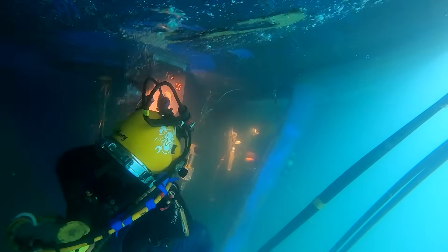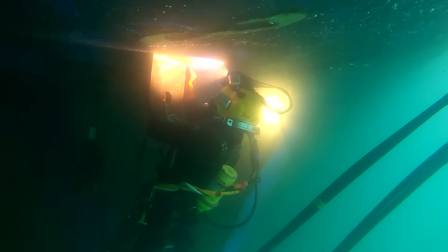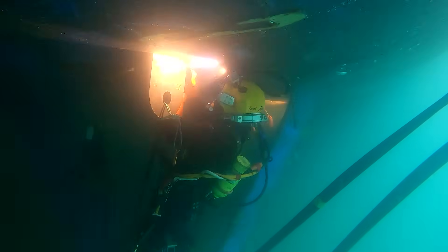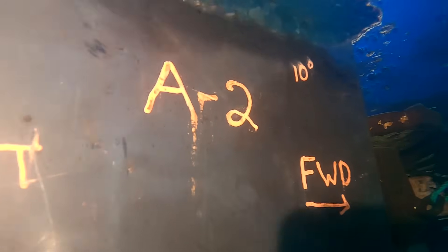We've got a lot of weight and stress going on these pad eyes, so we want to make sure everything's right. If you have it at a funny angle you have a chance of fracturing — it's made to be pulled straight up and down, so proper alignment is really important. It's a really nice fit-up — no gaps at all. Fit-up is everything, as any seasoned welder would know. A bad fit-up is going to give you a heartache all day long, so take your time and make it right the first time.